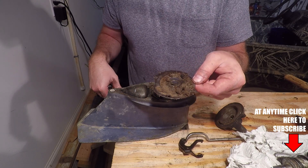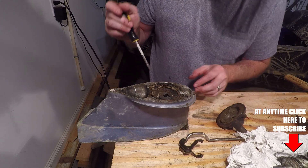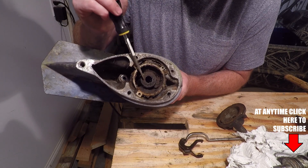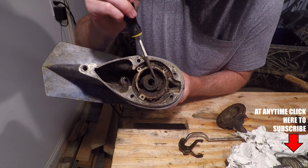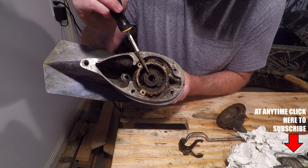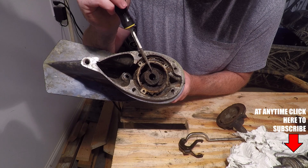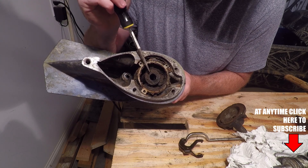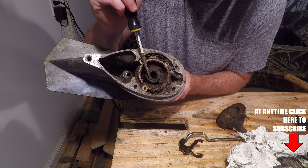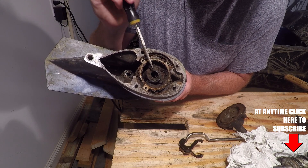This plate should come off, and that will now expose the upper seal. It's kind of messy, but here will be our upper seal and underneath it will be a roller bearing that we need to inspect. If the roller bearing is missing any of its pins, you'll need to replace it. You'll also need to replace this seal — it will come in the seal kit — and whenever we do this we need to inspect the roller bearing underneath it.